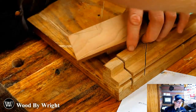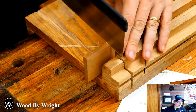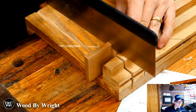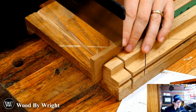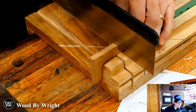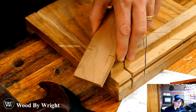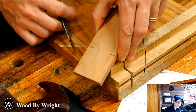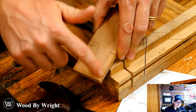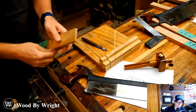I'll set it up just like before, starting on the far side and running down the line. I'm just being careful and slow because there's no reason to go faster. Same thing on this side — except the stop mark is on the other side. Now we need to cut on an angle, and this is where people get confused and scared. With power tools you have to set up angles, but with a hand saw 90 degrees is just an angle — it doesn't matter. The tricky part is starting on the corner, which can be a little difficult.